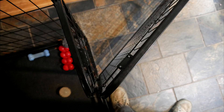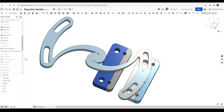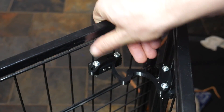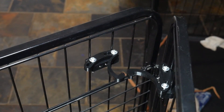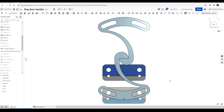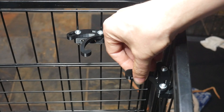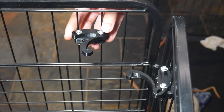So far so good — everything fits the way it should and the two pieces are in rough alignment. A reference picture from above and then back to the drawing board. My first solution for the interfacing parts was elegant in design but not very practical in reality. The concept was to have two identical hooks with a thin mount so they could flex out of the way to uncouple them and allow the gate to open. As you can see, the slight angle between the two halves meant the hooks didn't quite line up, and this is a project where I want a final outcome that is predictable and reliable. One feature I did keep for later designs was these slots for mounting, which would allow me to rotate and align things better.